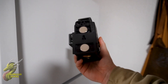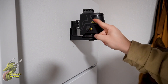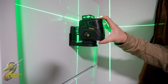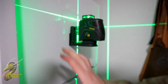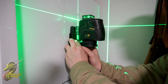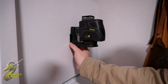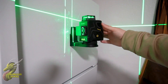Now I'm going to show you guys how to actually get this thing set up. We're using the magnetic mount here, but if you want to, you can use a tripod mount on this magnetic mount or the mount itself. You want to make sure that the buttons are facing up, because if you have it tilted upside down, you're not going to get an accurate level due to the self-leveling feature built inside. Once you turn it on, it's automatically going to default to whole room mode. It flashes every five seconds until you're entirely level. You can flip up that lock switch, which will lock it so that when it is not level, the lines flash quickly. Once you get it level, those lines are going to stop flashing. If you tilt this out of orientation, it will also unlevel itself.